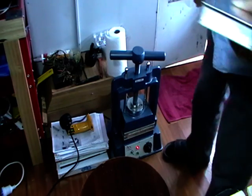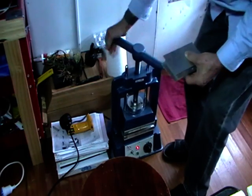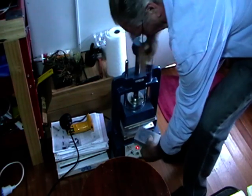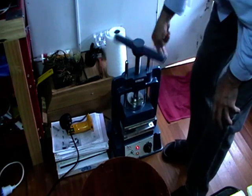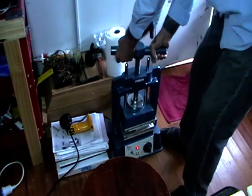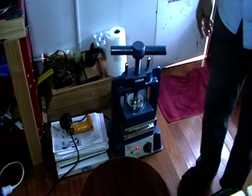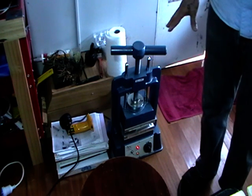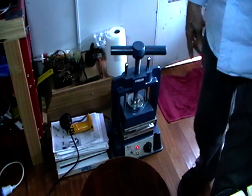I've got this sitting on the floor at the moment — I haven't had time to mount it. It's at the proper temperature, so just slide that in and we want this nice and snug. This is at 155 degrees, and it wants to bake for seven and a half minutes per layer of rubber, so it's 45 minutes for this one. Set your timer.